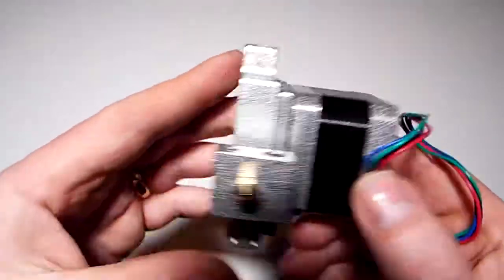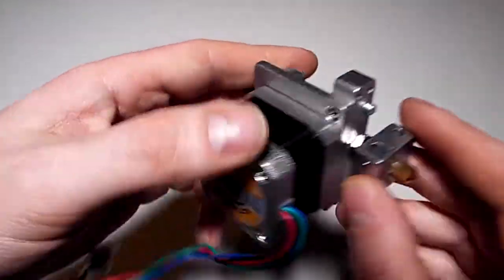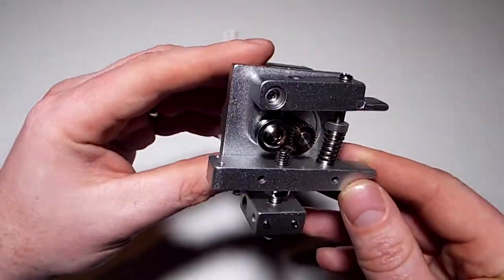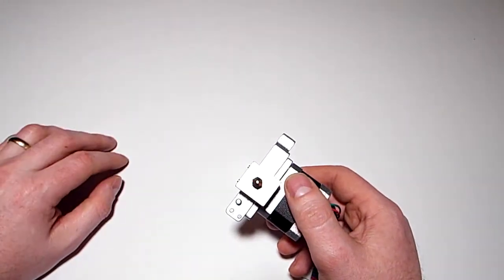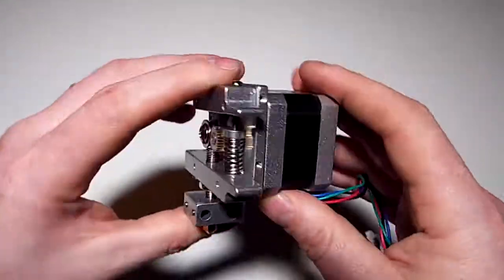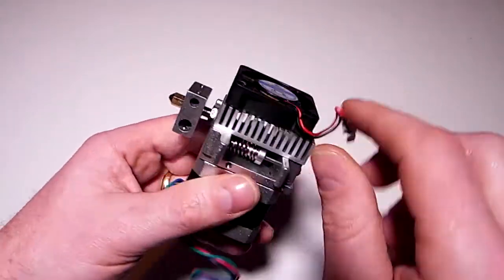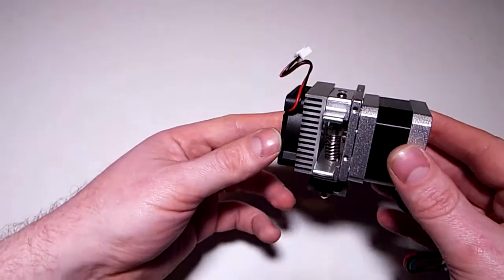This is Part 68. We had to put a bolt onto the shaft near the bottom, put four grub screws loosely into the holes, then thread this up until it just touched the bearing, pull it back a quarter turn, and then tighten the bolt against the main body. That's that bit done. I've also done the modification with the heating wire - it was a pain to do as originally designed, but we'll see how that goes. Part 68 complete, on to Part 69.